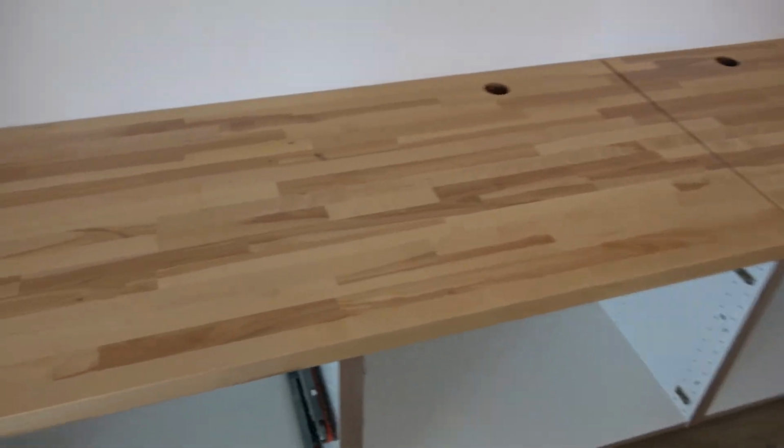So when you go to line up your tabletop, obviously the first thing is you're gonna wanna make sure these edges are even on the end here, right? So overhangs. And then in the middle here, you can see there's a gap, it widens and then it gets skinnier up front. And that's because the wall is not straight, right? The tabletop is completely square, but the wall is not.